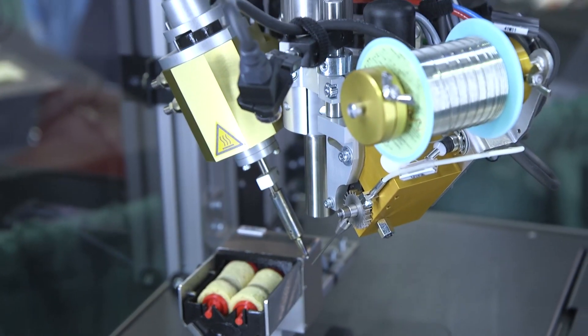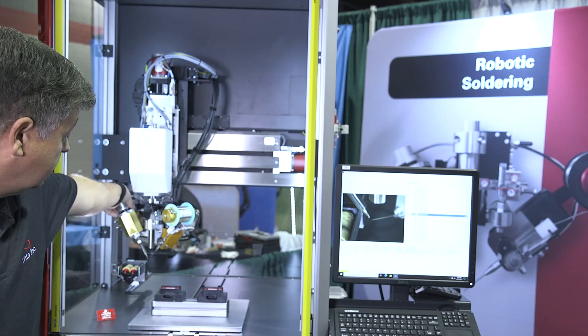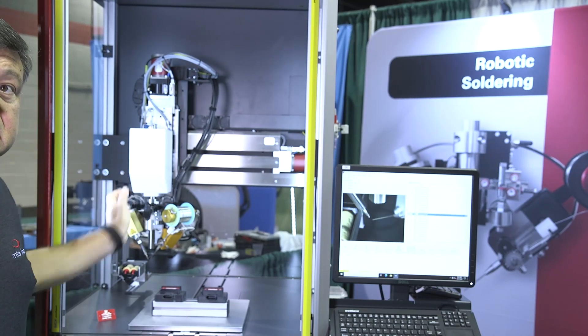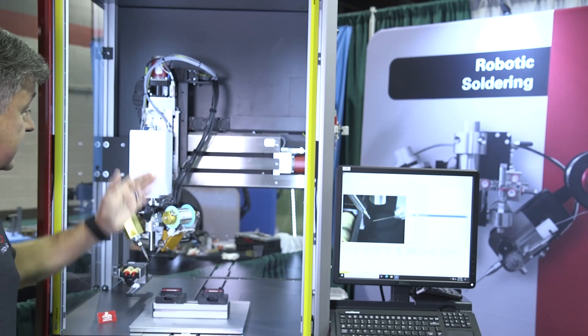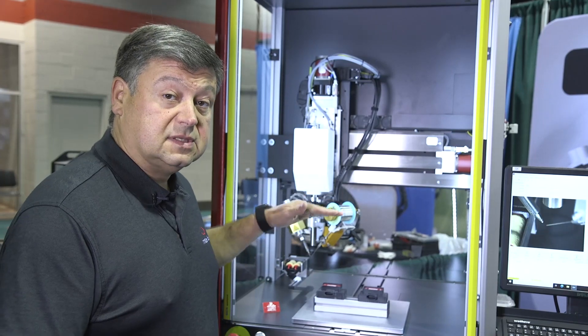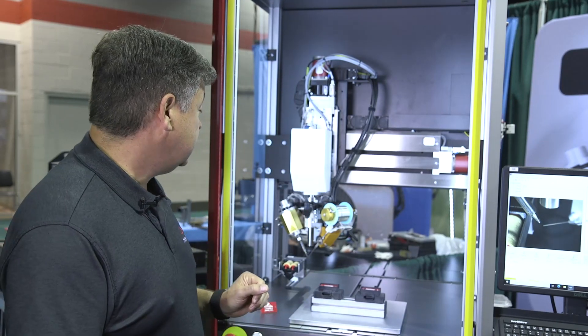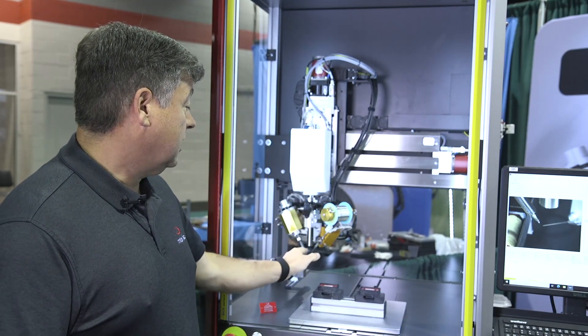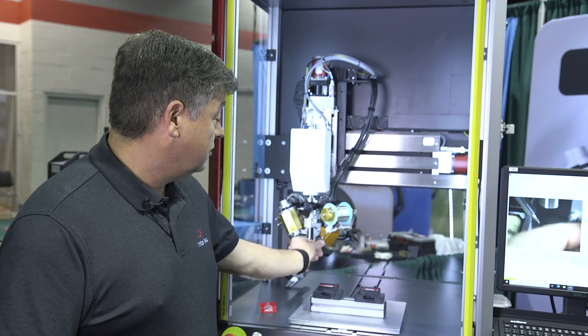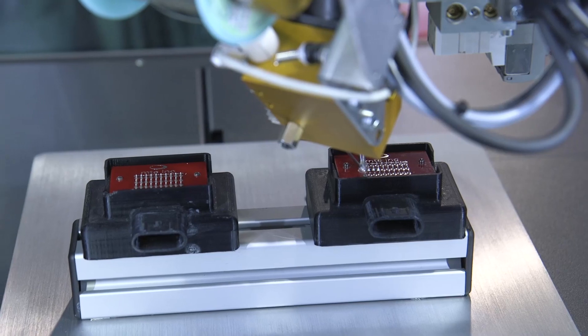What really makes our soldering technology unique is the soldering head itself. We have our iron on one side, pneumatically actuated independent of the z-axis, which gives you good compliance with your part since parts can have different z-heights from part to part. We have our wire feeder directly on the head, and we have the ability to monitor and know exactly how much wire was fed to every joint because we monitor the motion of the solder wire, not the rotation of the drive motor.